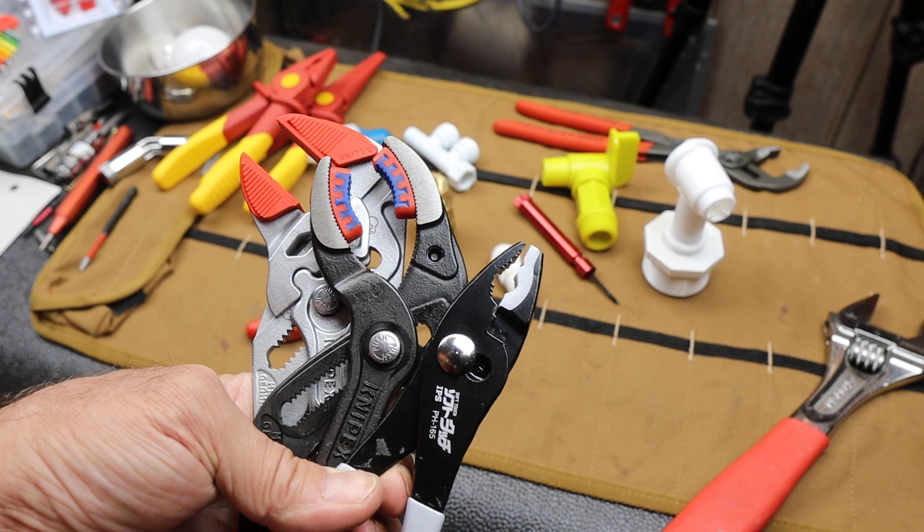In fact, it would work just fine as a soft screw extraction plier if you could get enough purchase on the screw. Many times you might need more than one — on a little fixture, if it's really wedged in, I may need to grab it here and then grab it with another pair of pliers. These are really handy for any kind of coupling where it's just knurled — easy to get stuck or corroded. You can grab it and unscrew or tighten things up. The inserts are held on by a screw; without them the jaw won't grab much, but you could pop them off and have a funny-shaped plier.